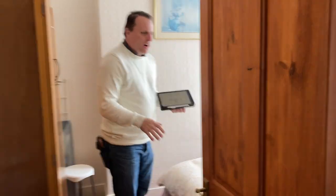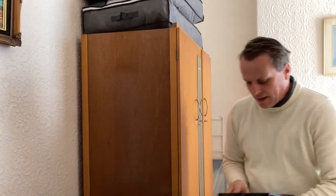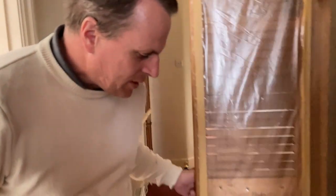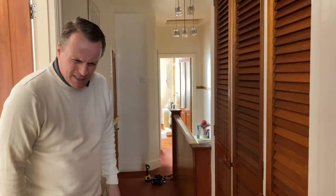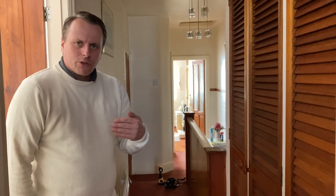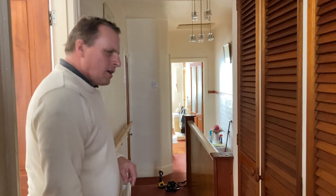We'll try that in the back room as well. The wall that separates the living room and dining room downstairs — and front bedroom and back bedroom upstairs — is the main centre load-bearing wall to the house. We'd expect our floor joists to span front to back onto that wall. With fitted carpets throughout it's difficult to confirm, but in this airing cupboard there's a raised bulkhead on the floor. It's highly unlikely the floor joists go side to side — highly likely they bear on that wall, because that's how hundreds of thousands of mid-terrace houses were built.